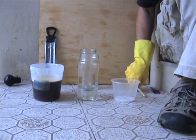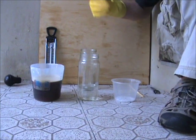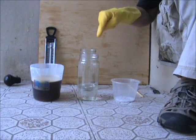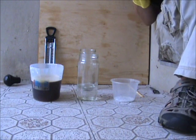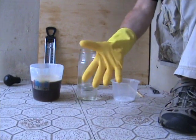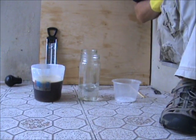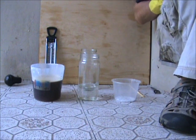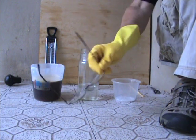I'm just going to quickly go into the aspects of health and safety — the boring parts. With making biodiesel, there's going to be a mixture of sodium hydroxide with methanol, which is going to make methoxide, which is quite fuming and abrasive. So what you're going to need is a pair of rubber gloves, preferably a long-sleeved shirt, and also a well-ventilated area because the methoxide gas is pretty strong.